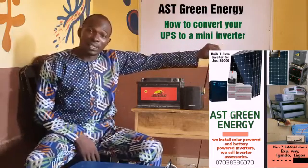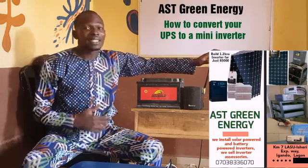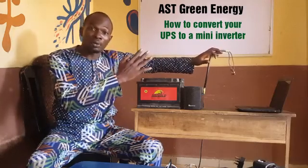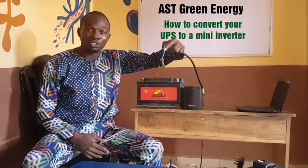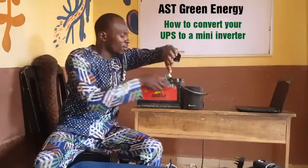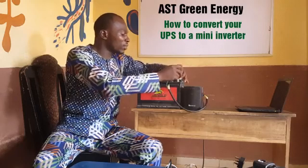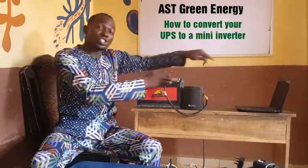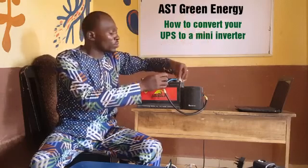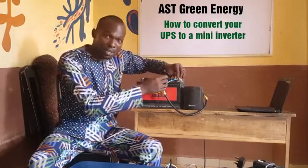The terminal of the battery inside the UPS — you open the UPS and you connect the terminal of the battery: positive and negative. You connect them outside, throw them out so that you can have something like this. Then you connect the external battery terminal to it. On the positive, connect the positive to the positive terminal coming from the battery inside. You disconnect that from the internal battery and discard it because it's probably weak. Connect from the positive inside the UPS out to the positive terminal of the external battery.